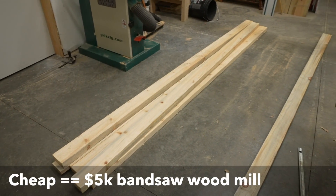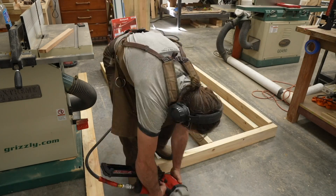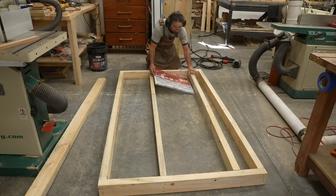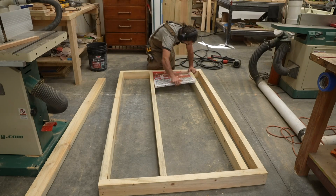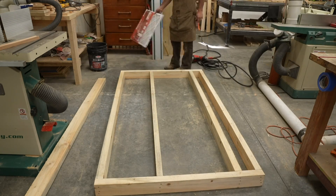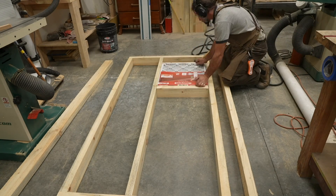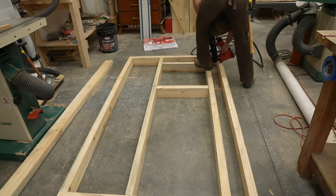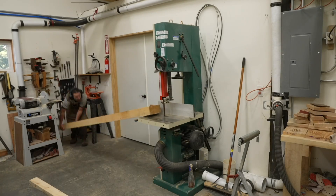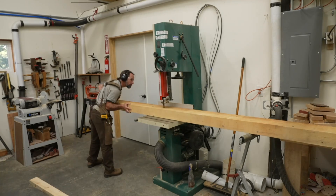My other goal was to build it as cheaply as I could. I milled a lot of the wood myself from dead trees on my property and spent about $100 on insulation. I started by framing a basic wall using my pneumatic nailer and framed up a small box around where the filter would be. I got the filter from one of the big box stores — the thing to do is to buy the most expensive one that can filter the finest particles. I decided to build things ad hoc around the dust collector.